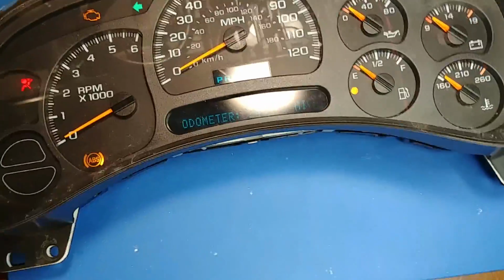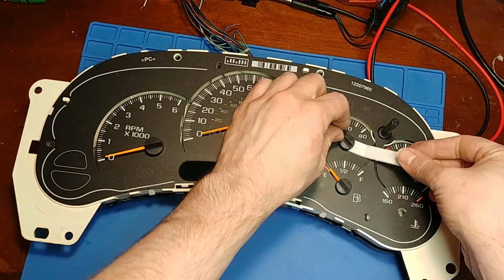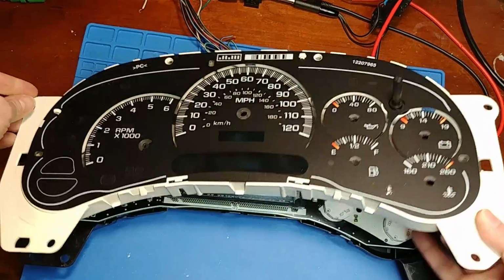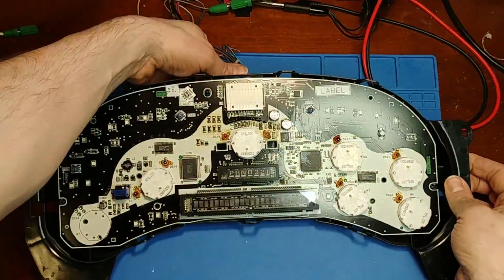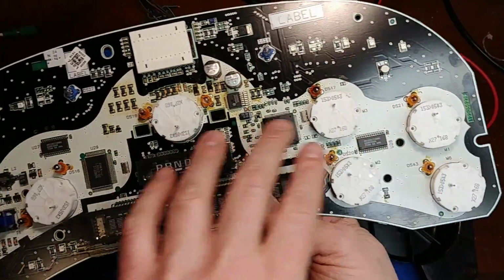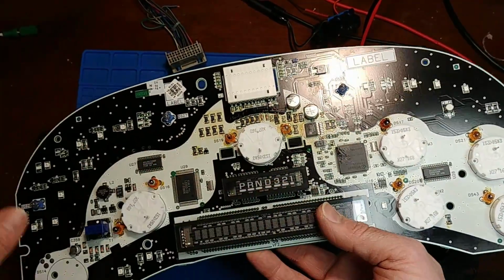All right, so now to open this thing up. Okay, so first thing I'm looking for is, are they using the upgraded stepper motors? And yes, they are. These are all X27s, so that's good. These are the latest models. If this was an older rebuild, it would have had X25s in it, but since this is about 5 years old, it does have the latest upgraded X27s in all positions, so that's good.